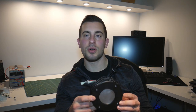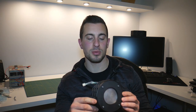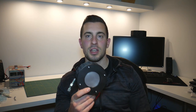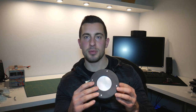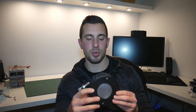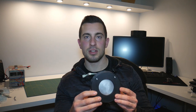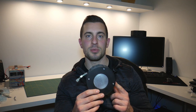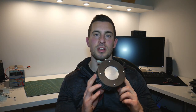The second thing I would change is the power supply. In this video I used a 12-volt constant-voltage supply, but peltier plates work better with a constant-current supply. With 12V constant it leveled out around 3.5 amps, where you could likely push around 5 amps to really maximize the cooling. At 3.5 amps it was pretty cold — almost like touching an ice cube — but a constant-current supply could do better. Just keep in mind you'd need to adjust the LED wiring since you won't want to push 5 amps through the LEDs. That's it — thanks for watching! If you have any questions, leave them in the comments below.